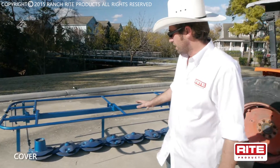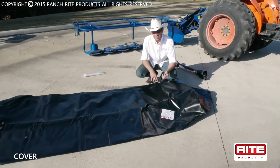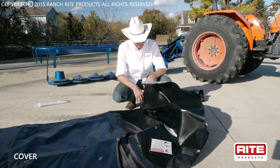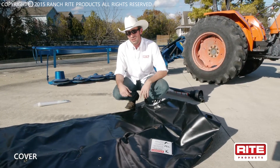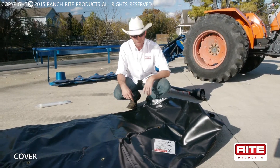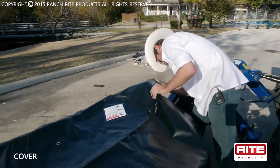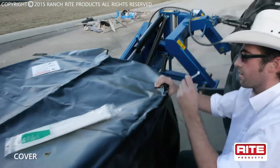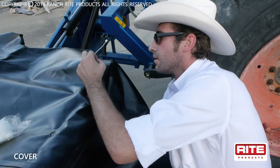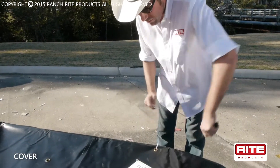Now, if you've got all your curtain frame assembled and everything's on and nice and tight, lay out your curtain in a manner like we've got it now. Always have your labels facing up and keep the split towards the tractor end of the machine. We'll start by spreading it out and covering it over our curtain rods — get a hand to help ease installation. It's kind of like making a king-size bed by yourself while the old lady keeps messing with you. Don't tighten all your zip ties up until you've got the last one in, otherwise you'll catch hell trying to move it around. When you get the last one tight, remember to cut all the ends off so it looks better — that's how we do things here at Rite Products.